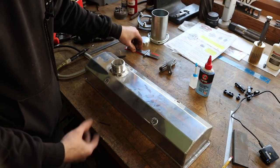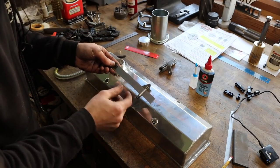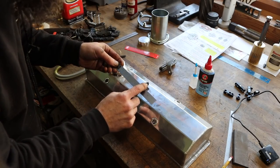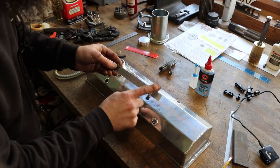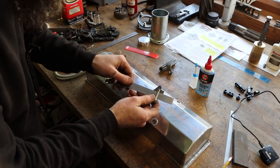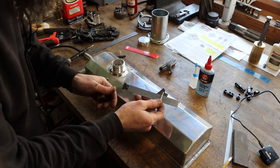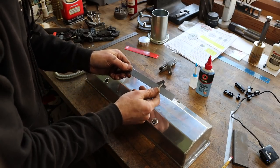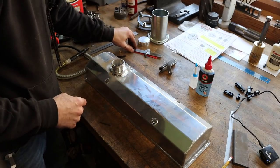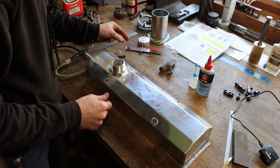So I picked that up, and also, because I can't just buy one thing, I picked up this nice Starrett 604R hook rule that actually came with a set, this number 22-C drill point, 59 degree drill point gauge. So now you can hook a drill onto the hook, you can measure the height of the flute and the length, rotate it 180 degrees and compare it to the other when you're sharpening them. So that's really nice. I did not have one of these. I do have a drill point gauge, but it's just the generic version. So this is so much nicer. So really happy to have that.